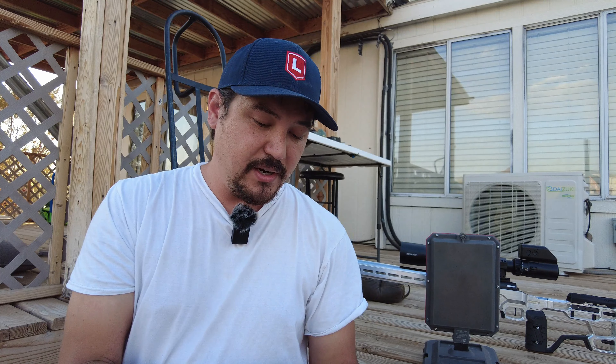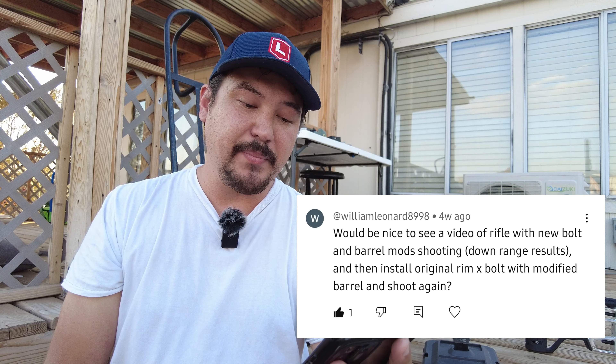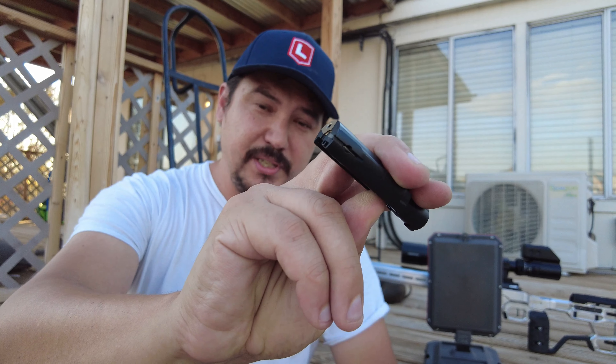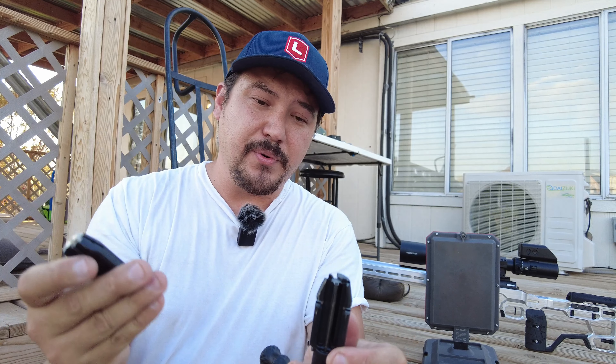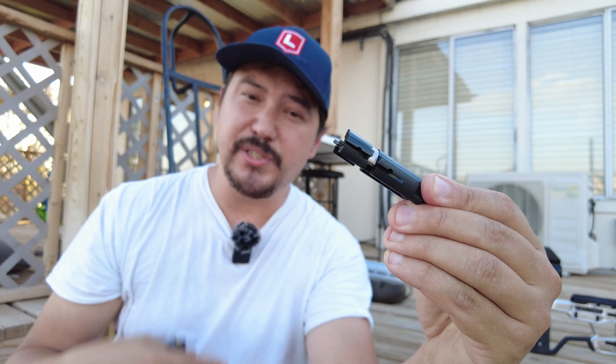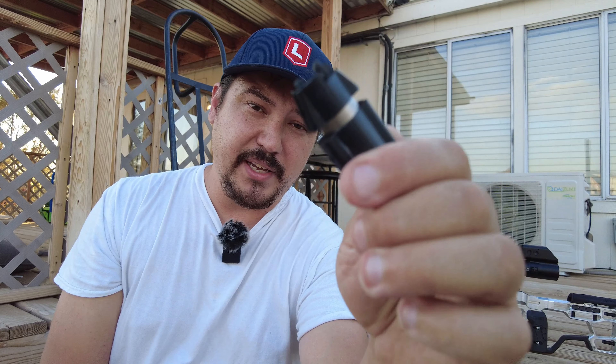The video request is from William Leonard 8998, who said it would be nice to see a video of the rifle with the new bolt and barrel mods shooting downrange results, then installing the original RimX bolt and modified barrel and shooting it again. The benefit to this modification on the RimX is that even though I have to put extractor relief cuts in the barrel to allow for the relief on these two extractor claws, it can still utilize the factory bolt assembly. So the modification I plan to offer folks is another bolt head — you'll receive this modified bolt, and my service will also include putting the extractor relief cuts into the barrel. The original bolt assembly can still be used, and you can also utilize the new bolt head modification and swap between them.